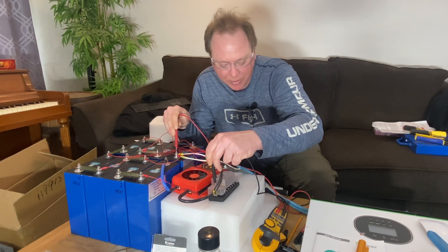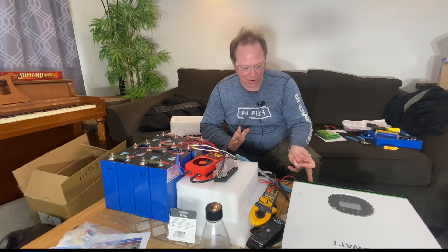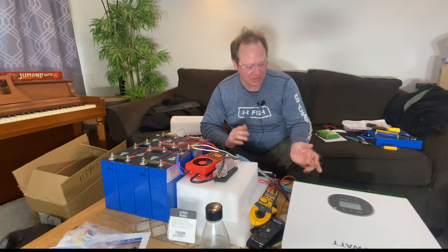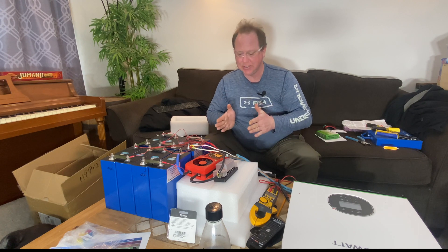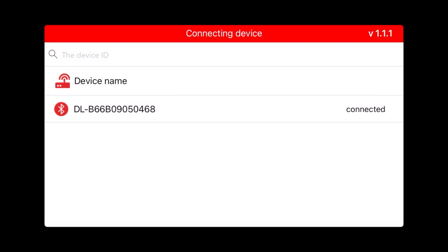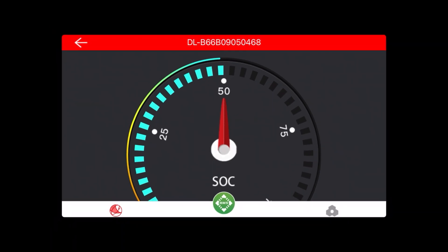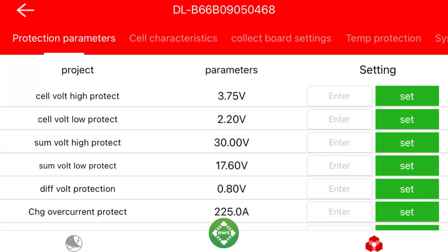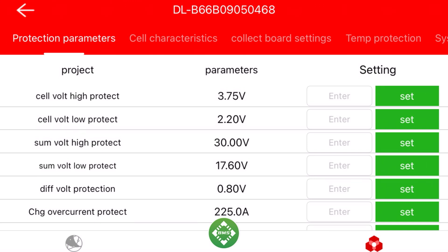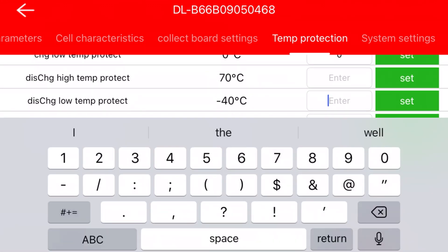Pressing the button — nothing audible or visual. But wait — it's on! I've got voltage coming off the out lead. I'm going to turn the inverter on just for a few seconds to confirm I get power, but actually let me get the app and check the BMS settings first. In the app, state of charge shows 50%. I went through all the settings in the BMS and the inverter and made sure everything was set to my satisfaction before turning the unit on.